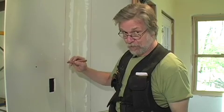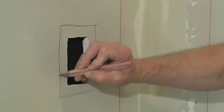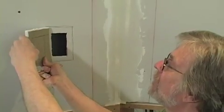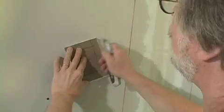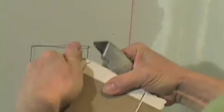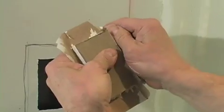What we're going to do is take a piece of scrap and cut a piece of drywall that's about an inch longer in each direction, then cutting from the back of the drywall, we're going to score it to reflect this shape here, then peel away the waste so that the paper facing of that scrap becomes our drywall tape.